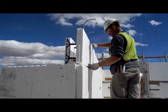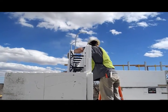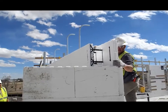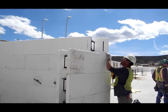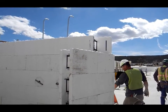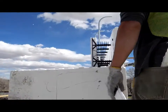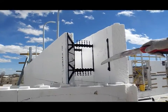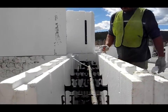There's a little bit of angle going on with the wall assembly, and a crew guy with Beatty is setting that block for the next course. It's got a hard turn to it, so it's just a field cut of the block — set them, and then the opposing wall will go right into the miter, into that end form, just like so, so that the next section of the wall is formed.